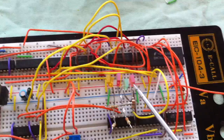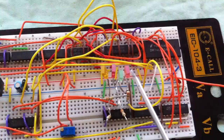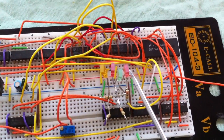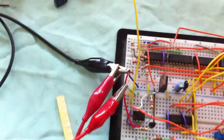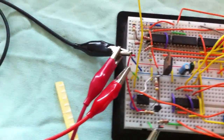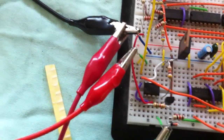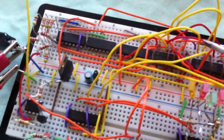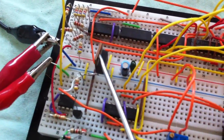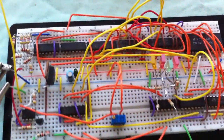The yellow light is the LSB while the red one is the MSB. It is driven with plus and minus 9 volts because the operational amplifier TL072 needs plus and minus voltages, while the other circuits are driven by a linear regulator 7805 at 5 volts.